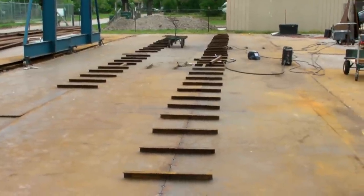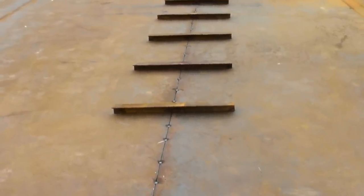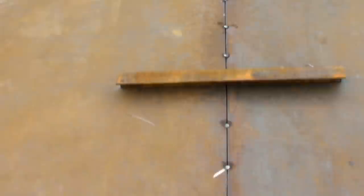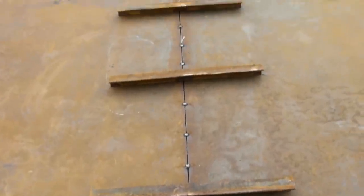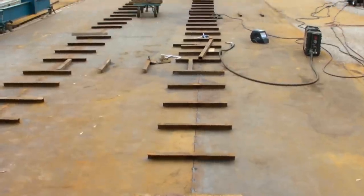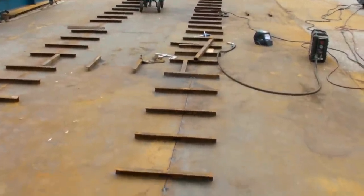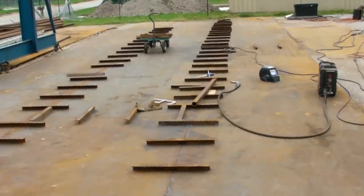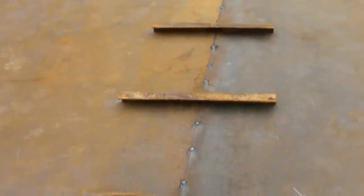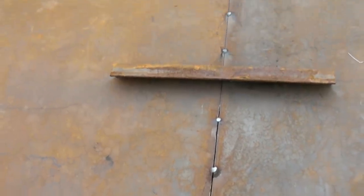It's real important to have Strong Backs because it helps us keep our plates aligned evenly with each other, and that's real important for eliminating or at least reducing distortion. Getting those two plates butt-jointed beautifully is what we're after. The Strong Backs help line them up so they come together in the same plane. They also give us strength when we're going to lift this sheet, turn it over and start working on the other side with just the Strong Backs and a few tacks in between.